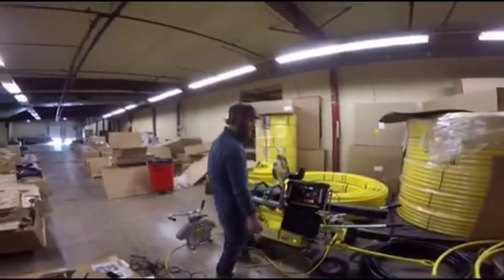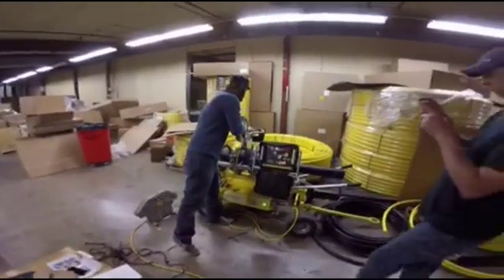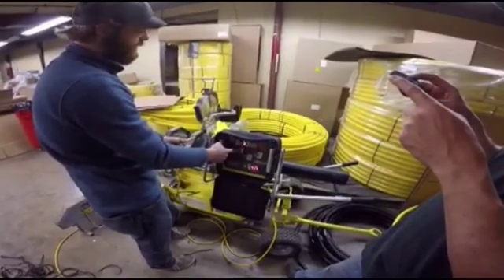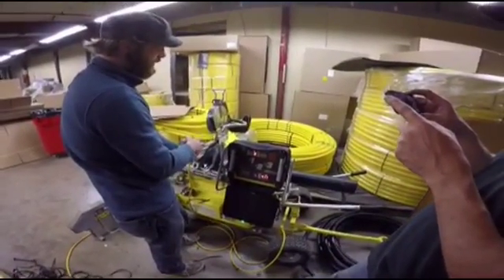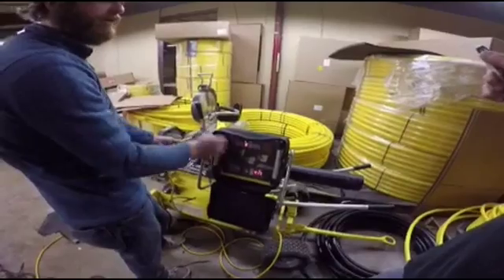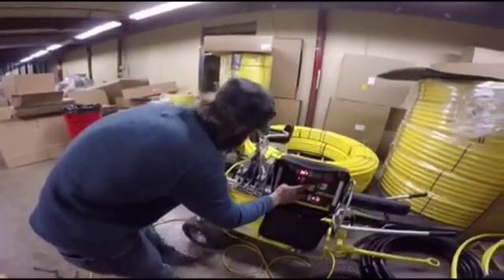We're at the point of heating. We have the heating plate set at 415 degrees Fahrenheit. On the heating plate itself it also has an analog temperature gauge. We'll set the heater plate in position. The first period of the cycle is preheat — push this button, those jaws are going to close and apply full fusion pressure. We're going to watch to make sure we're in full contact for maybe five seconds, then switch it over to heat soak. It brings it up to full pressure; you look at it to make sure the pipe's in full contact, and a bead is starting to form.